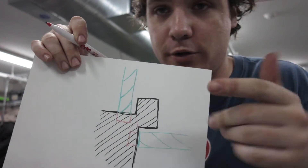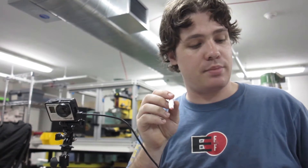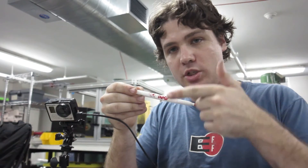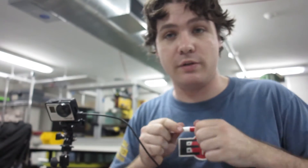For instance, on the first part tutorial from the PocketNC website, if you're machining those impeller blades, you end up machining them from two sides — like this, and then you rotate it one-seventh of a turn, and you machine them again from the other side. And if your tool length is too long, you'll machine all the way through them in a few places.